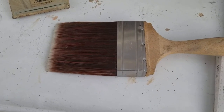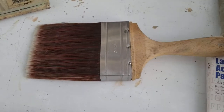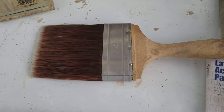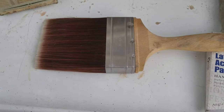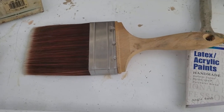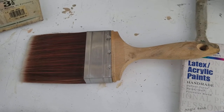You should be using a big brush because you can handle it — you're stronger, you're younger, you can work that four inch brush. Yeah, at the end of the day you're going to be more tired, but you're going to have another two or three quarts of paint on the wall than the guy who doesn't. That's more money in your pocket if you're working by yourself, cutting in or cutting and rolling.